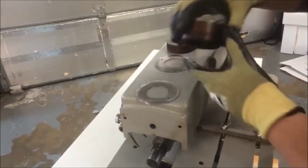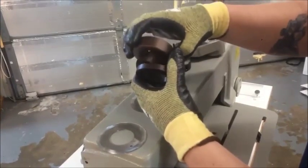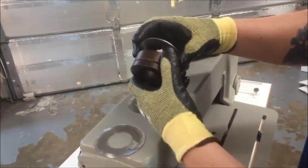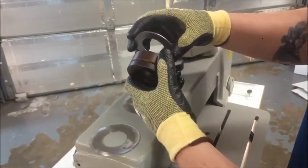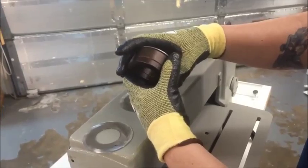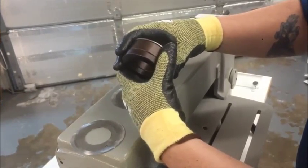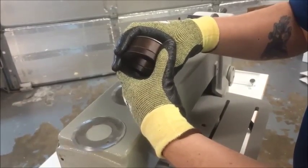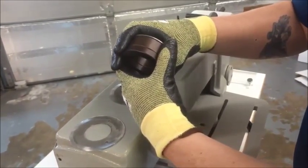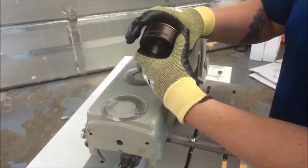Now I want to talk a little bit about the spacers. There are a couple of different spacers used with these machines. The first is a 20mm spacer, the second is a 10mm spacer, and then you've got a series of smaller ones: 5mm, 3mm, and 2mm spacers. This is a 2mm spacer in my hand right now. So this stack-up is 10 plus 20 plus 2, making it 32mm. This is important because most of the hardware we buy for our projects is built to millimeters — if you see hardware labeled as inch and a quarter, it's probably actually 32mm, and hardware built to inch and a half is probably 38mm. So all these spacers are based on millimeters, and so is most of the hardware.